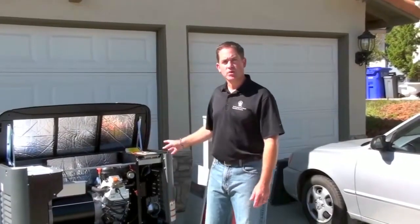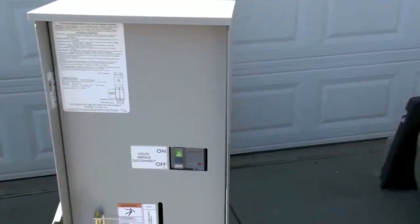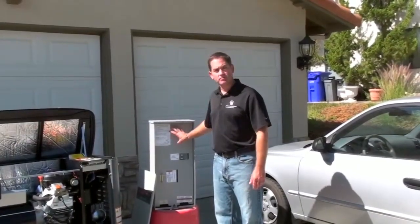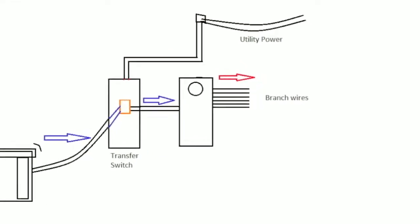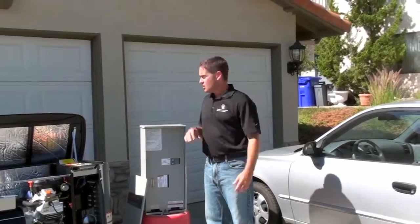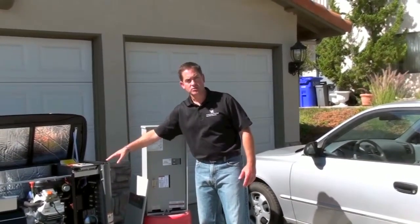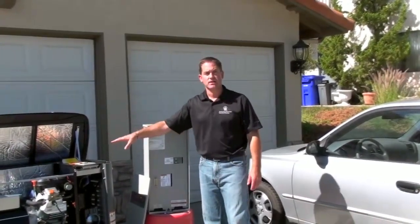In order to complete the system, there's one more component that needs to be purchased. It's called an ATS, or automatic transfer switch. This unit right here is installed near your electrical panel, and it's a critical component in that it disconnects your house from the utility before the generator starts. That's very important, because if this starts — as with any generator — it could backfeed electricity into the utility and could actually electrocute a lineman who's working to restore your power. So you have to have an automatic transfer switch, which, when told to by the computer control system, will shut off the utility power and start feeding your house with electricity generated by your standby generator.